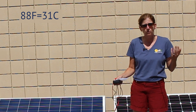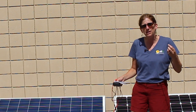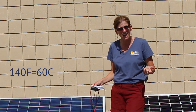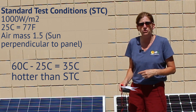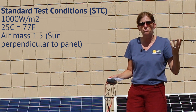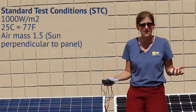It's about 88 degrees out right now, which for a northern girl like me is really hot. I did measure the voltage of these panels and the temperatures. The temperature of the panels was about 140 degrees Fahrenheit. When solar panels are rated, they're rated at 77 degrees Fahrenheit or 25 degrees Celsius, so these panels are almost twice the temperature of standard test conditions. I also measured the intensity of the sun and it's right at 1000 watts per square meter — perfect sunshine, panels at a nice angle. Really the only thing different from standard test conditions is the temperature.